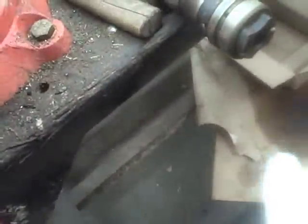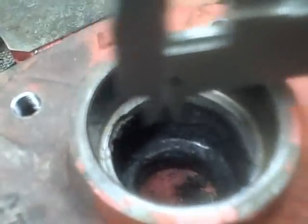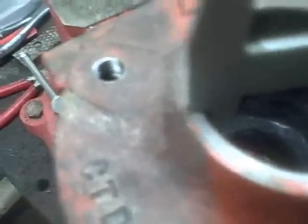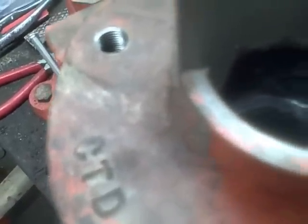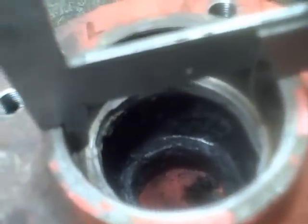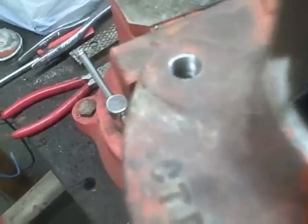What we want to do first is check the bore, and that'll tell us what the outside diameter of the seal has to be to fit in here. You always want about a thousandth or so over. So we stick this in here and just kind of turn a little bit — we want to try and find center. Work that one side till you find a nice center. There we go.